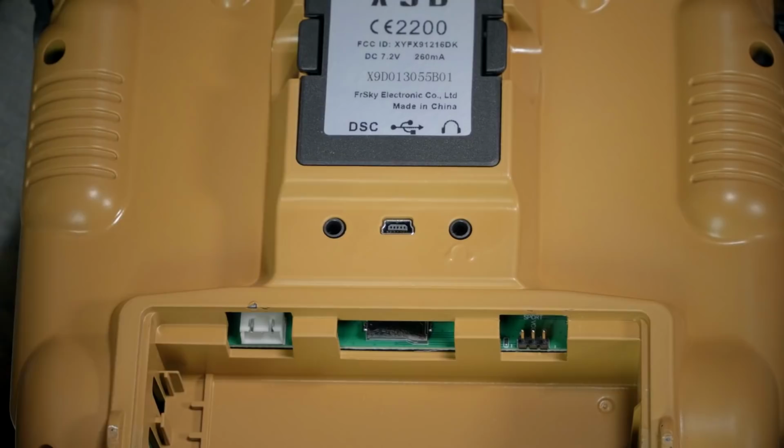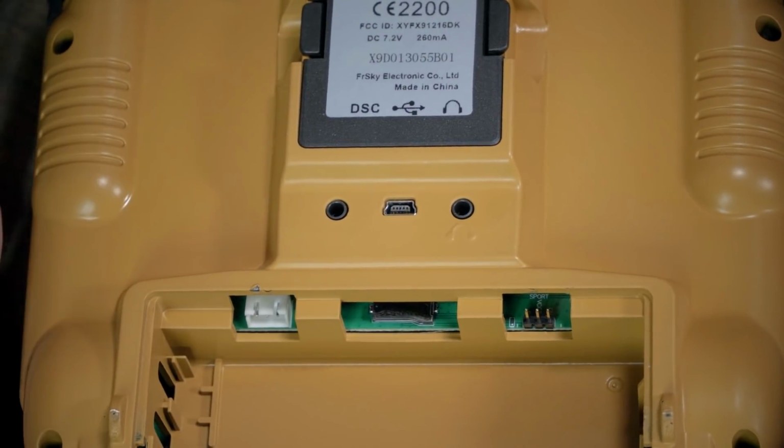The next thing to do is take out the SD card. And it turns out he does not have an SD card in there at all, so that is not an issue. It might surprise you to learn that a problem with the SD card could prevent the radio from powering up. But the SD card contains data that is essential for OpenTX's operation, except you can operate the radio with no SD card at all. It'll work fine. It won't have audio alerts, but it'll basically work. But then sometimes if you do have an SD card, but the SD card is messed up in some way, the radio will refuse to boot. So taking out the SD card just fixes it.